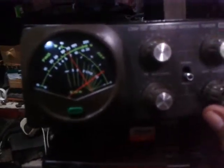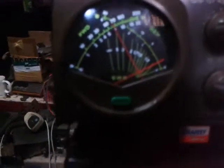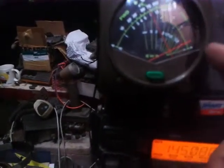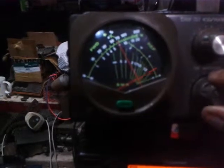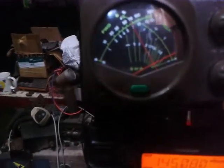We will try to adjust the antenna matching to lower down the reflected power. As you can see, I now have a 60 to 62 watts on the reading and I got the lowest reflected power. The best result is to zero the reflected power so there will be no return power and we can gain a flat 1 SWR. Since we brought down the antenna matcher to the lowest point, we will transmit again and adjust the TR matching to the lowest point.